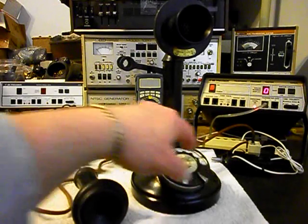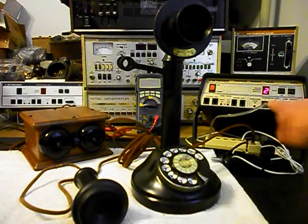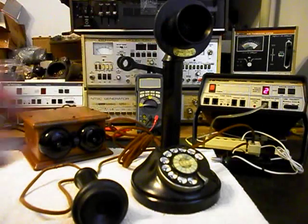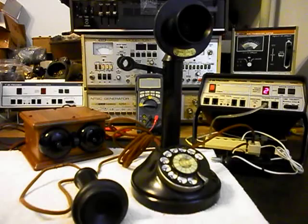I'm going to end in a 2. Now I want to transmit into the handset — every time you see this red light light up, that's an indication of 100% modulation on transmit. I'm at least two feet away from this telephone, and you can see how bright that light is getting — that's way over 100% modulation. So you really don't have to get up to the spit cup to talk into this telephone. In the old days they would have had to get right up into the spit cup, and it was harder to hear people back then. That's why these amplified electronic transmitters we design and build here are so great.